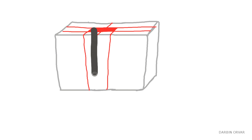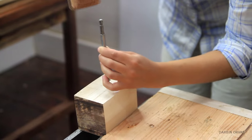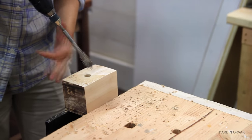To remove material in the middle, I'm using a drill with a 5 eighths inch spade bit. First I'm finding the center in each section. I'm drilling at a slight angle, trying to follow the angle of the sides to about halfway through, then repeating on the other side.